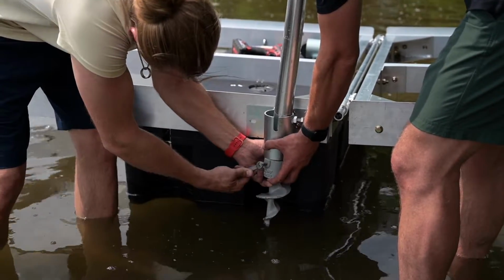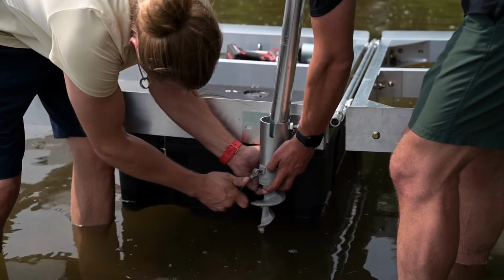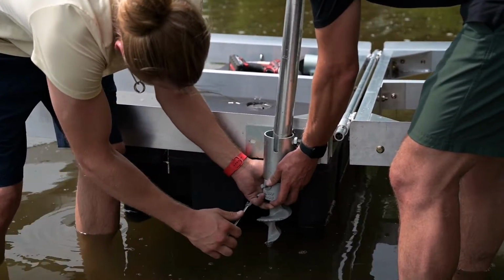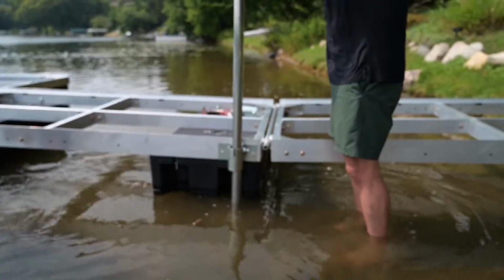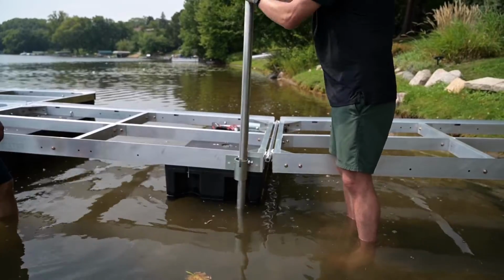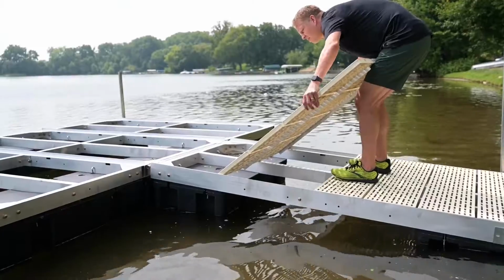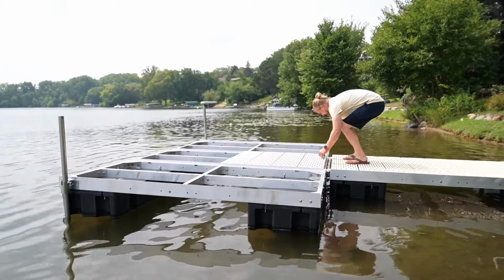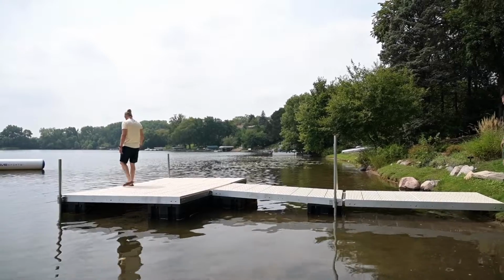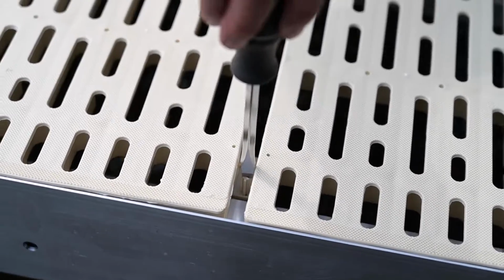We are using pilings to anchor. The piling sleeves are wide enough to allow the dock to travel up and down on a 1.5-inch inside diameter Schedule 40 galvanized pipe with an auger. This is a rigid method of anchoring and is generally preferred for water depths of up to 4 feet. Starting with the shore side, add panels one at a time, walking over the installed panels to go deeper. You can tighten deck lockers from above the decking with a flathead screwdriver.